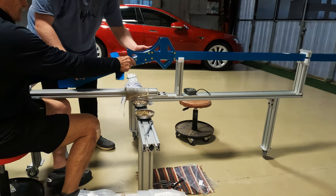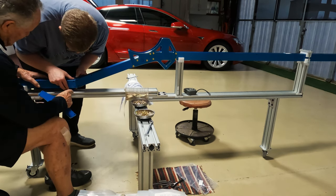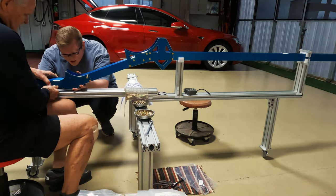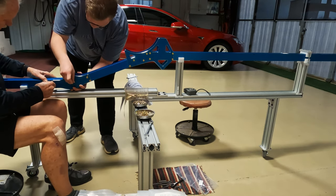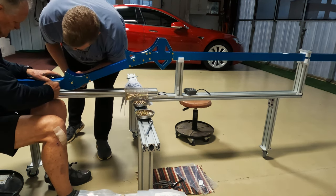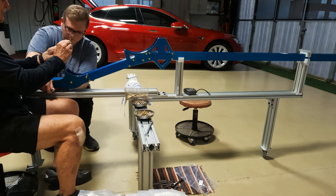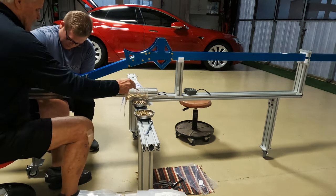Let's push this forward. Wow, look at that — he's got this angle set up. Look at that seam — it's perfect. Sometimes you need a little hammer to tap it in, or a reamer. On aircraft bolts, they don't cut threads, they roll them. And when they roll them, you can see this part expands and swells up, and it has a problem with it. Let me get a little mallet and we'll tap that in.